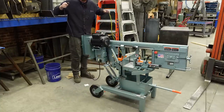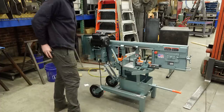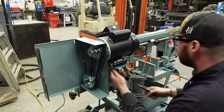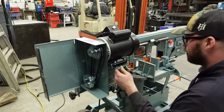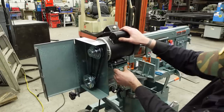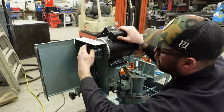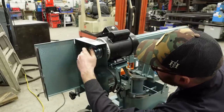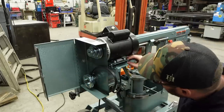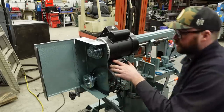To unplug the saw — for all these safety officers — and get a socket set and some Allen keys. And as Wyatt showed me, needle nose pliers. Yeah, that wing nut was on there — it kind of defeats the purpose of a wing nut. So that releases the tension so I can take this belt off. Now we can take that pulley off and unbolt the motor. Looks like I might have to take these cotter pins out and take this pivot pin out to get to the motor bolts easier.